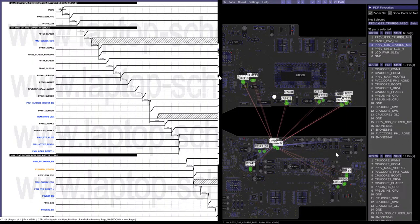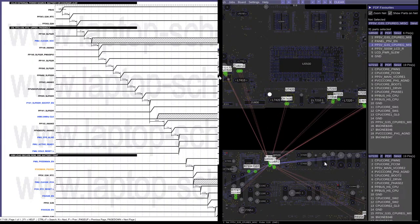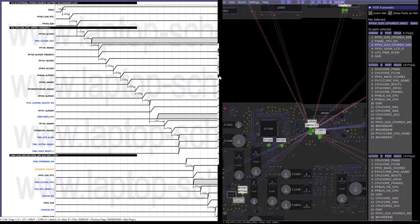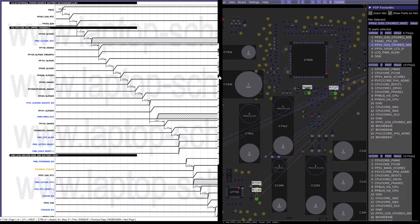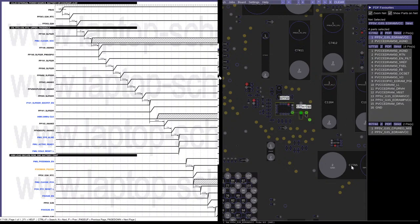So when we're first looking through all this, we're like, oh great, MOSFETs, nothing seems to be working right. This is probably a dead CPU. So something's going on with a MOSFET or a CPU. We're not going to be able to fix this. But then I noticed that these chips down over here, where it's coming into, these guys, which I know my mouse pointer is in the wrong spot, but look at the flag instead of the mouse pointer. These guys here are shorted. Right here, if you put your probe here, both of these are the output of this chip. They're both shorted.